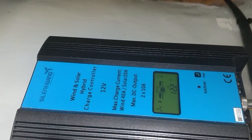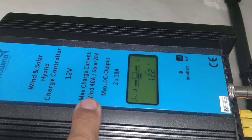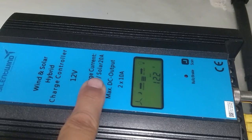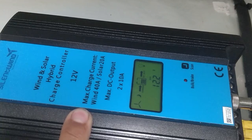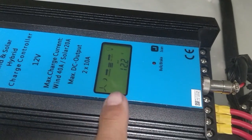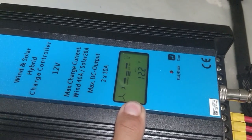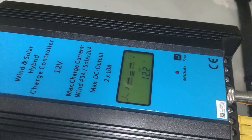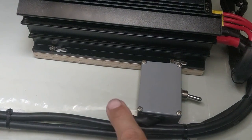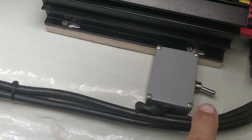Something else I need to show you is the wind generators. Here are the wind generator regulators — they come in here and convert power from the wind. You can see it is 40 amps from the wind, and you can also put solar on at 20 amps. This will show us how much wind power we are getting, whether it's working or not, and also what the battery levels are. For the wind generators we also have a manual brake — we can just switch it on and it will brake the turbine.